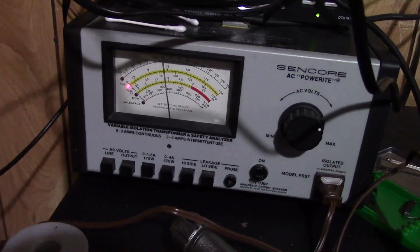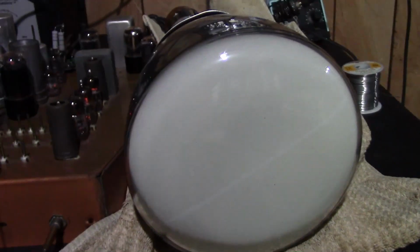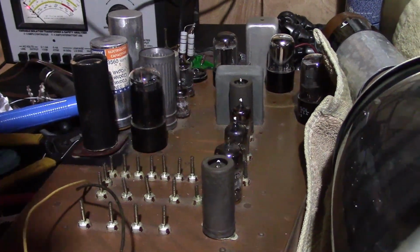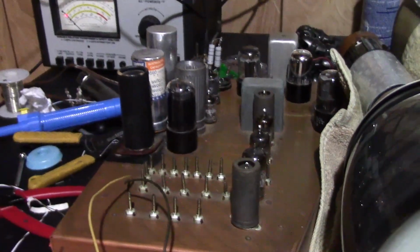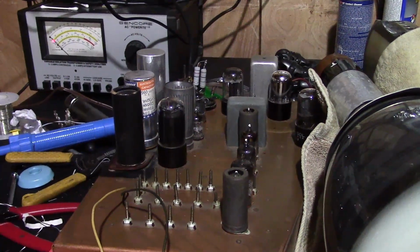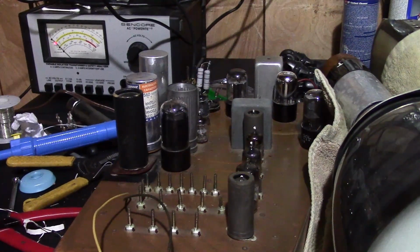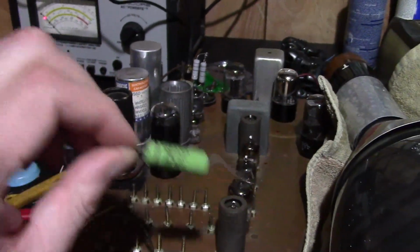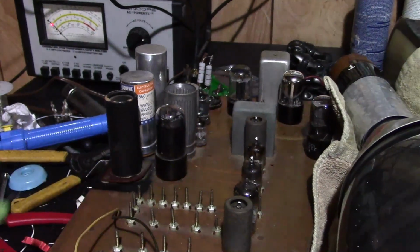Now it's warmer to the point where we've got that same weird current surge situation going on. All righty, well, this is going to be interesting. I have not seen anything quite like this before. So I was thinking it might be the power supply. But I tested the caps at pretty much their full rated voltage, and they weren't leaky. Oh, and I also tested at least one of the same type of those other green caps down there, and it wasn't leaky at all.